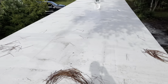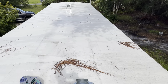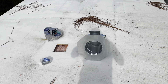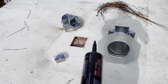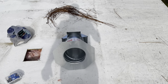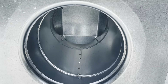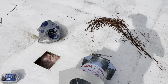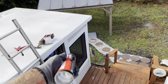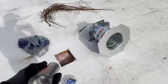Easy, guys — you can do this on your trailer. If you don't have enough venting and you need vents added, this is a simple project. You need a skill saw, some screws, a caulking gun, and some vents. Now, these vents came without screen — it is important that your vent has screen. So we're going to go down and just get some standard screen and stuff the inside of both of these full of screen so no bugs can ever get into the attic area.